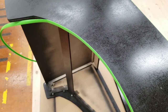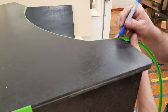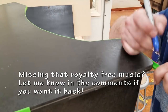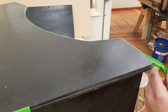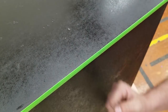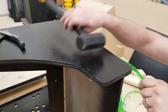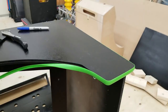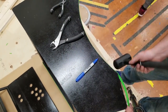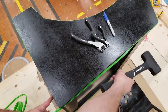In the future I probably wouldn't do such a sharp little turn there — I would keep it a smooth transition. It might cut a little bit nicer, but either way I think it turned out great. Line it up as best you can. I set it up so that the cut would be on the bottom and you wouldn't really see it anyways. If you were using artwork for your arcade you'd probably want to put it on before the T-molding. That way any excess you can just hide underneath it and then cut it off with an X-Acto blade.